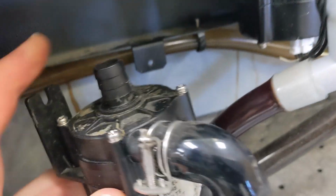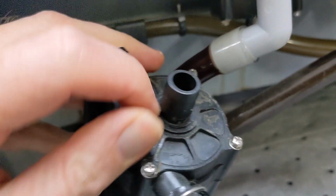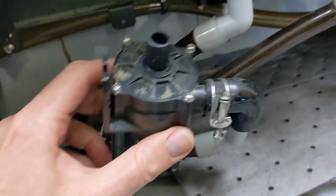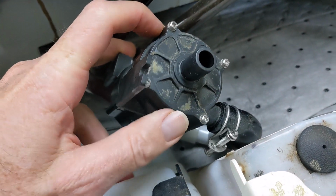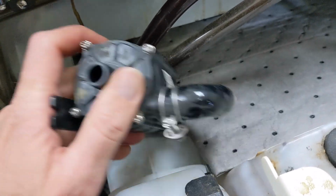and now I have it off. It's pretty hard to get off of the hose on there. Putting the flat bladed screwdriver on there, trying to pry the hose up while I pulled down on it, got it to come off. So now from here, I would unscrew these 4 and then take this part apart to make sure that there isn't just some sludge in there that's blocked it, but I've already done that.